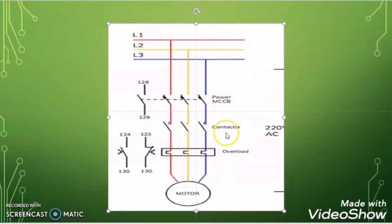Let us understand this by a diagram. Here you can see that the overload relay and the contactor are in series with the motor. All the current going to the motor passes through the overload relay. When the overload relay detects a current more than the preset value, it gives a command to the coil of the contactor to de-energize, and as the coil de-energizes the contactor opens and breaks the circuit. For more detail on the contactor, please watch my video on contactor — the link is in the description below.